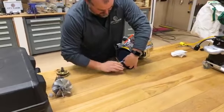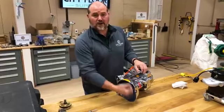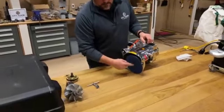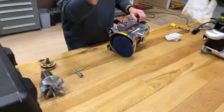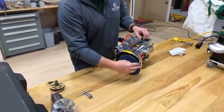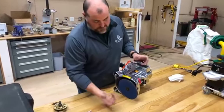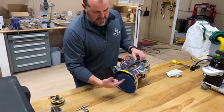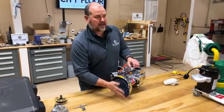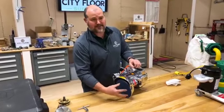I've also seen people put four or five pieces of paper on and then just tear off the disc when it wears out so they have a fresh one underneath. That does a couple things. One, it can wear out the washer and make it paper thin. Two, it changes the geometry of the machine — you've created four or five pieces that now act as a fan and your edger dust pickup will be terrible. And third, as you sand you're creating heat, and eventually that bottom piece at 36 grit isn't going to cut like 36 grit by the time you get to it.